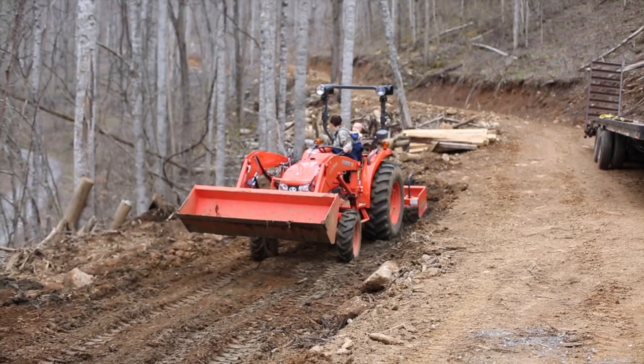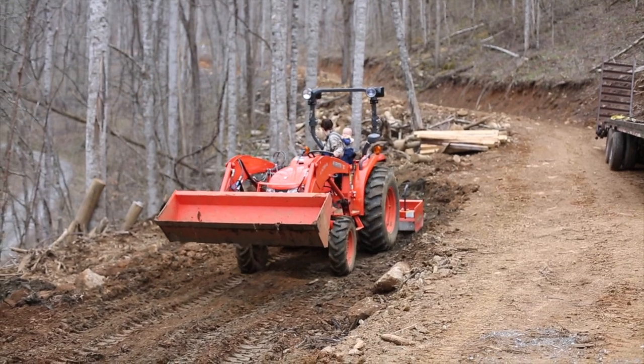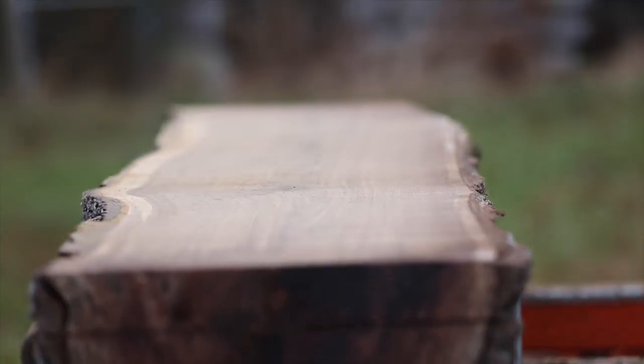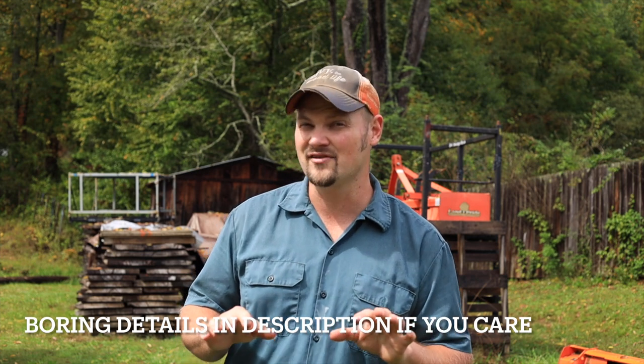Even more important than that is what happened to your logs before they got to the mill. If they were skidded through mud, dirt, and rock, it doesn't really matter what species they are — there's going to be all kinds of debris picked up in that bark and it's going to tear up your blades. I've done the math, and basically it's going to take about 50 to 75,000 board feet before the cost savings on blade changes pay for the debarker.